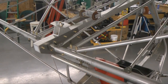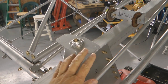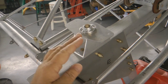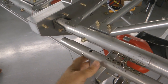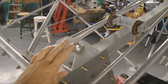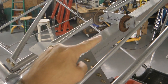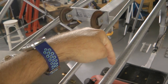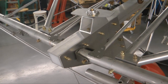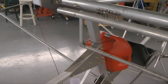Now I'd like to get started on finishing up the aileron controls. And that involves the bell crank here. That, of course, comes out to the ailerons themselves with the horn, which I don't have on here. And, of course, we have a connection cable that goes from here to our pulley and then down. And I found a problem with our horn, our bell crank horn that we built. Let's take a look at it.